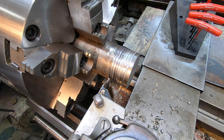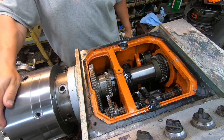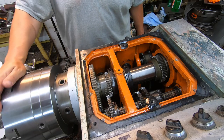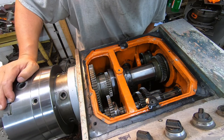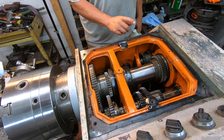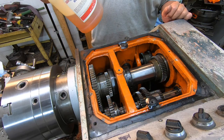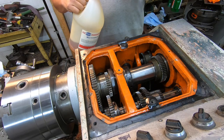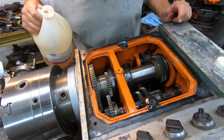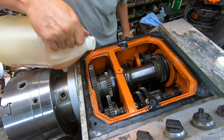I'm calling it quits and I'm going to make sure all these nuts are tightened up properly with the lock nuts and get the cap back on. The nuts are all tightened back up and we've got it adjusted right where it needs to be — I don't think I could get it any tighter than where we're at. I noticed the gearbox is a little low on oil — the sight glass is a little deceiving because there's a blob of oil in there, so it always looks like it's on level, but it's obviously low. I'm going to use my multi-purpose machine oil, 100 weight or SAE 30 weight gear oil, and make sure I get a little bit up in that bearing.